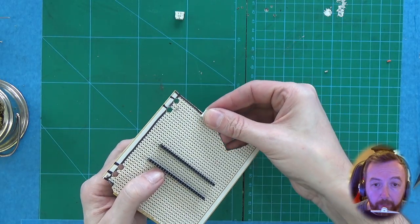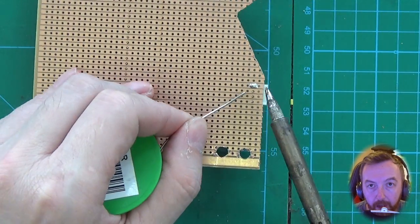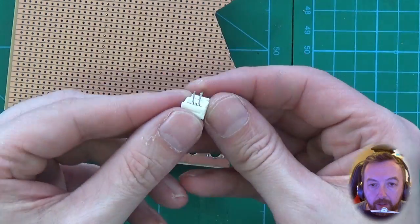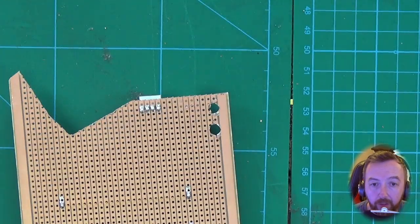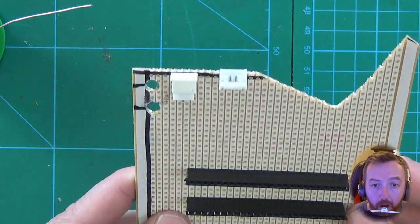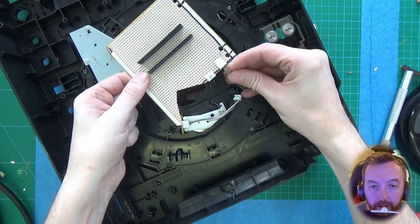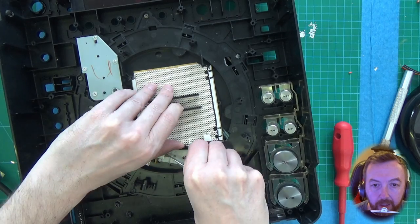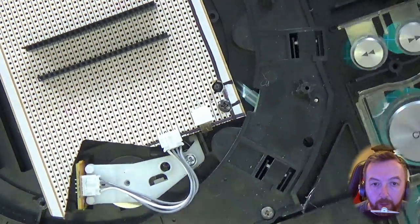Now we're going to solder them onto the PCB that we're making. As long as they're spaced out it doesn't really matter — we're going to do a jumper anyway rather than wire them direct to the Teensy pins. If we only use the outer two of the jog press connector, we don't use the center pin that's on its own. Be careful when soldering onto this veroboard — not too much solder, it's really hard to get shorts off. Let's do a test fit: the ribbon just pushes in and then the jumper just pushes onto the connector. There is our base PCB with the connections for the jog wheel in place.